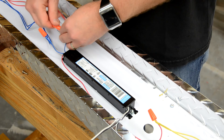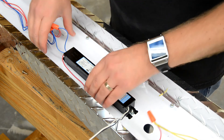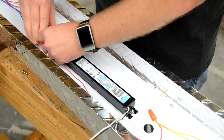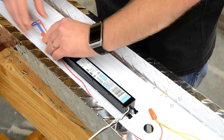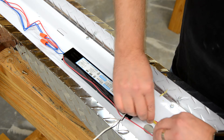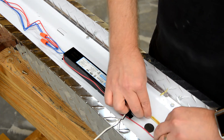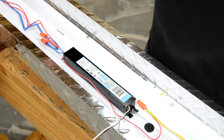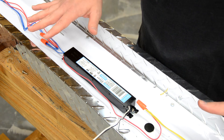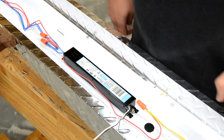So this is all wired up. The other thing I want to do is situate these wires so they stay out of the way when it comes time to reinstall the reflector, since the reflector goes in over this. It's wired, so now I'm going to reinstall the fixture, wire it to the electric circuit, put the reflector back on, put the bulbs on, and it should work.